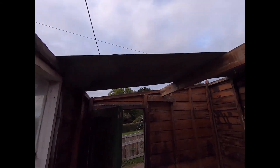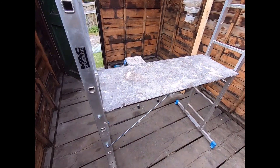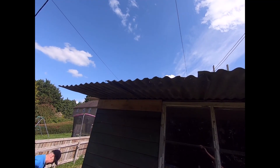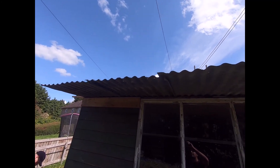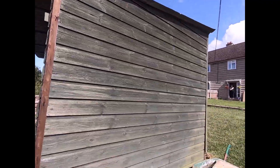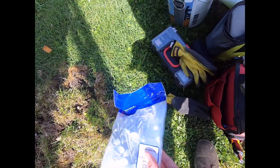We've got our first sheet of tin — I managed to source this for free off a very generous gentleman. I'm going to have to cut it to length, so I'll put it in place first just in case the shed isn't completely square. We've got a platform ladder and another ladder on the long side. All the sheets are now in place, overlapping by one rung, and initially just fitted loosely using a type of nail called spring head.